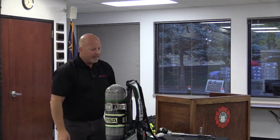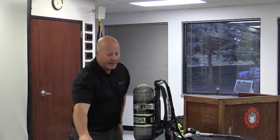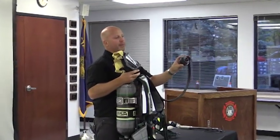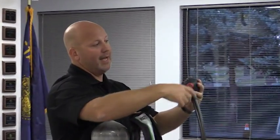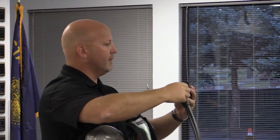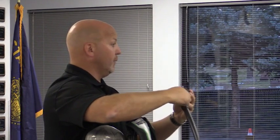Okay. Going then back to the SCBA, we talked a little bit about the second stage regulator. We talked about the lights and the microphone. Hooking the regulator up, what I have is a red knob, which is my bypass. Just like you have now, anytime you want to turn on the bypass, it's live. Obviously, this SCBA isn't pressurized, so when I turn it, nothing's going to come out, but I have the ability to turn this. The more I turn this valve, the more air I'm going to get out of my bypass. To the point I can turn it wide open.